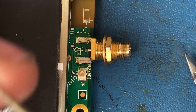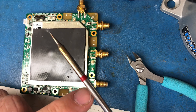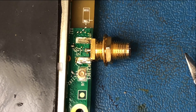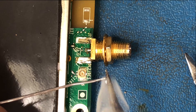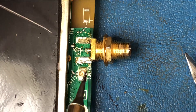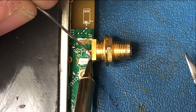Right now grabbing a different tip — this is made by Thermaltronics, it's similar in every way to the Metcal tips except they're a lot cheaper. That red band I just pointed out is their indication that it's a 900-degree tip, so these things get quite hot. They're actually quite perfect for getting into tight spaces with this type of solder that has little to no flux. I'm going to add some solder to it and try to get it in there so I can remove it from the PC board.